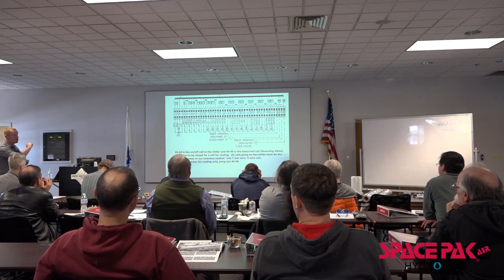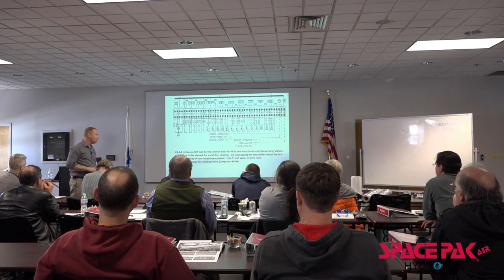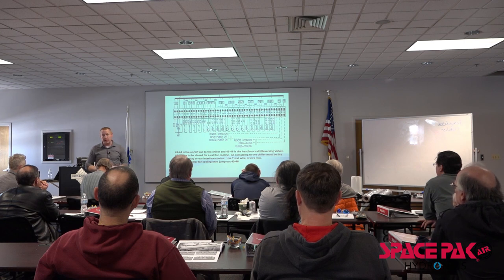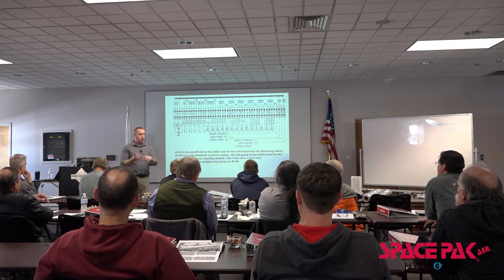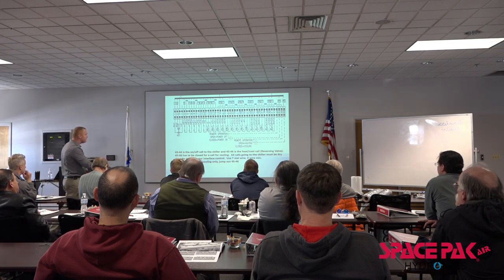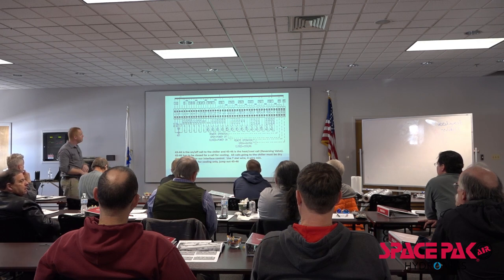It looks a little ominous when we take the cover off out in the lab area and say, wow, that's a lot of wires. Yeah, it is a lot of wire, but the cool thing is these units are super efficient and pretty dumb at the same time. We're going to send them a signal to turn on or off, and a signal to be in one position or the other for that three-way valve. It's either going to be in a heating position, cooling position, on or off. And those are just end switches, nothing super fancy. A lot of sensors we've got going on, but just on or off.